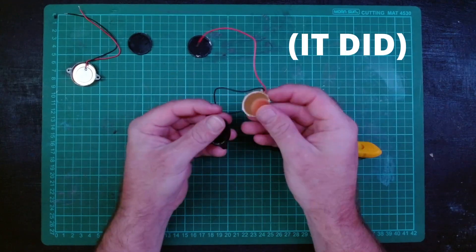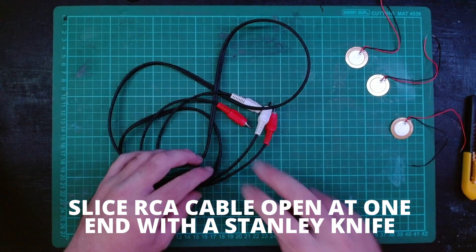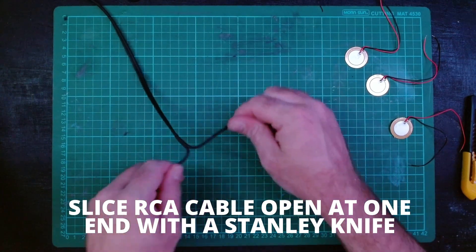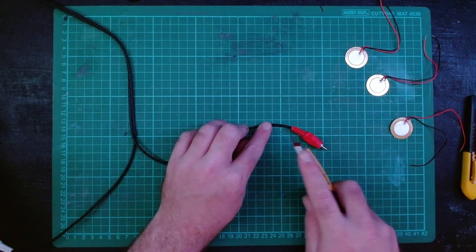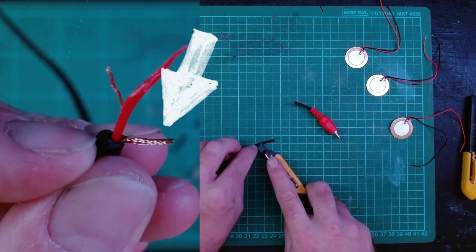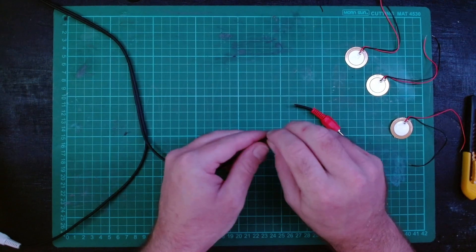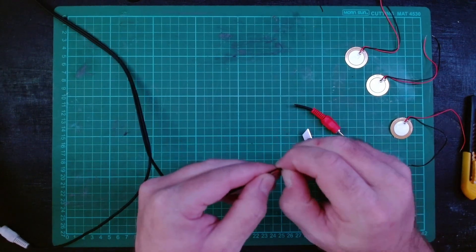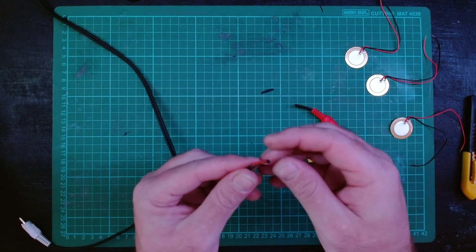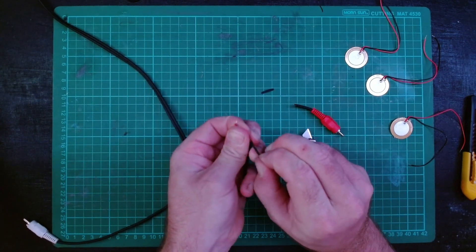As you can see here, I did scratch one of the discs a little bit — we'll have to wait and see if this actually works. Step two: take your RCA cable and slice one end with a Stanley knife. Cut on a 45-degree angle to expose the wires. There are two sets of ultra-thin wires — one you'll see immediately and the other inside a smaller rubber shield. Gaining access to the wire will require a little bit of finesse; I often grab onto the wire and pull lightly on the rubber coating to expose more wire. Take your time — this part is fragile. If you muck it up, simply cut another slice a bit further down the cable.